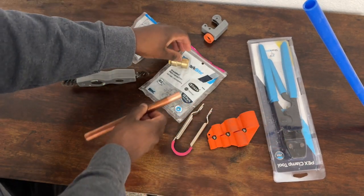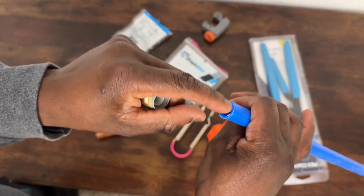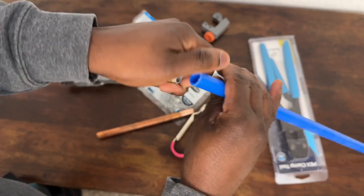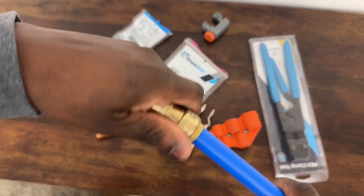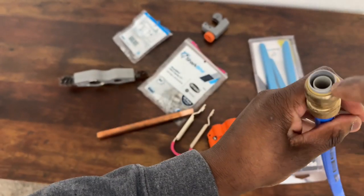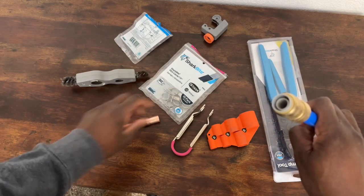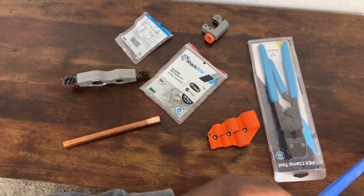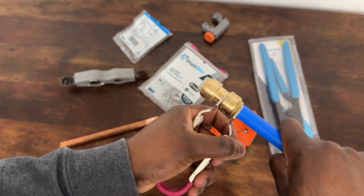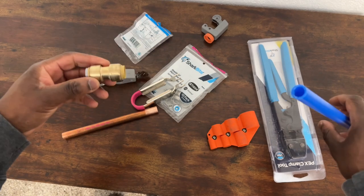That's one connection you can use for your DIY plumbing work. You can also use SharkBites with PEX pipe. With PEX there's not much cleaning needed - just make sure there's nothing that could block the seal. You just push it into the fitting the same way. The difference is: for copper there's a plastic insert inside the fitting that must stay in, but for PEX you need to remove that plastic insert before pushing the PEX in.